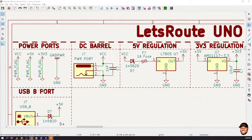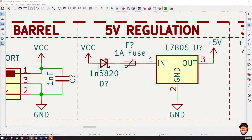Okay, so probably let me just explain the two quickly. Now, I'm using Schottky diode over here. Now, if you look at the other diodes, like 1N4001 series, I think the maximum current they can handle is about 1 amp. Is that okay? And usually, if a component has, let's say, a maximum current rating of 1 amp, you don't want to be driving it at that 1 amp, okay? Looking at our system, this particular voltage regulator here could actually deal with 1.5 amps. And even this fuse is limiting everything to 1 amp, okay? So, I just don't want a situation where the diode would have to take so much stress, okay?